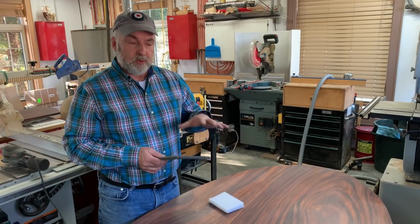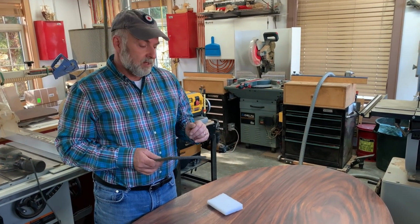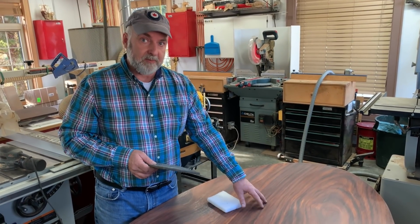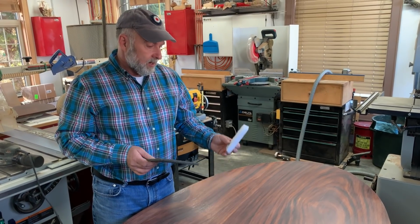After it's had the dust bumps knocked off, and after I've gone over it with this fine pad, there would be a lovely satin sheen. It would be as smooth as glass, but not quite as shiny as glass. Now, I don't have that effect going on here because this is an oil finish and there's not much of a surface film. So I'm just pointing out the difference.